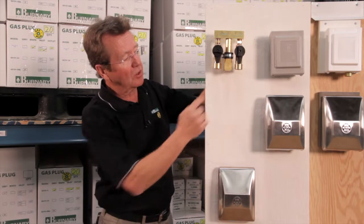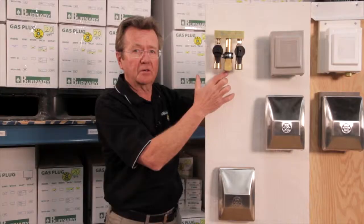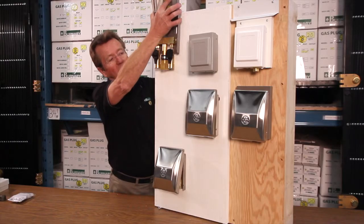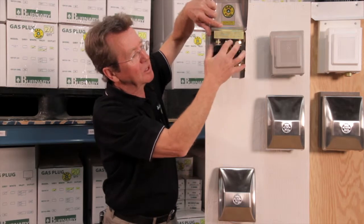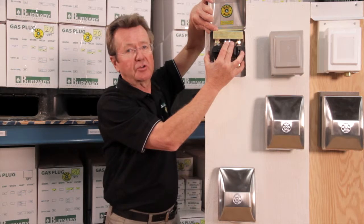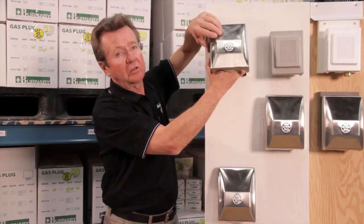For most other installations you just need a hole the size of the pipe, but for this particular one you'll need a slightly larger hole so the elbow goes part way into the sheeting. When you install it, you'll put the box over top, force your assembly back — there's a clamp inside the box — make sure it's straight, and line up the two holes in the base with the cushion clamps. At that point your assembly is secured to the wall. Make the box straight before putting the remaining screws in. Once that's done, you're finished.